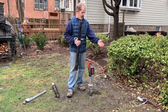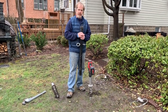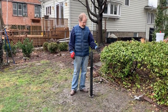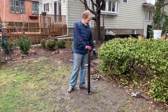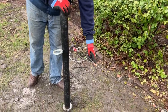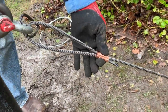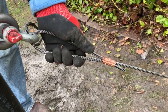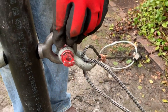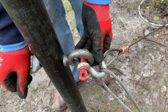We've made custom cable slings here. We swaged our own connections because these had to be a custom length. These are copper hourglass swages on galvanized cable. We have our eye bolt and eye nut as mentioned before, and then a single shackle connected to those.